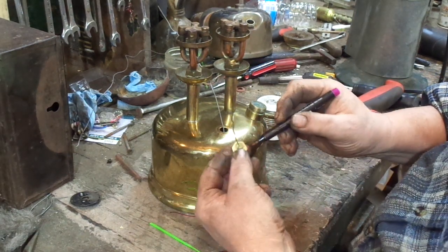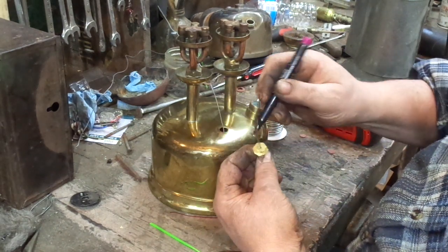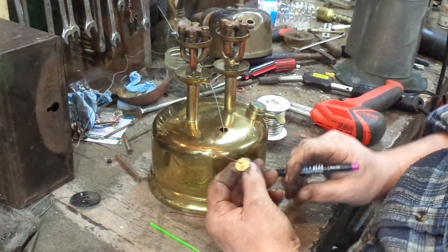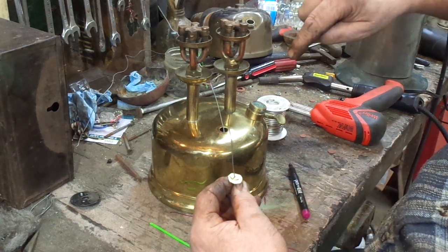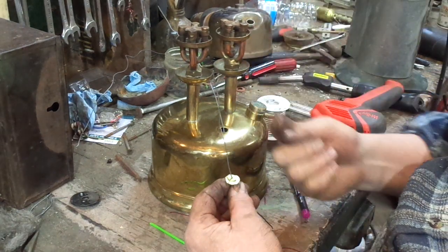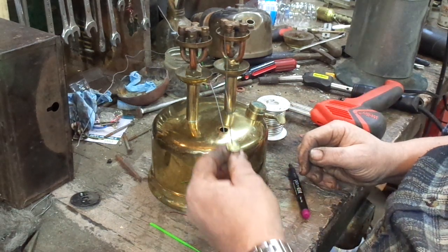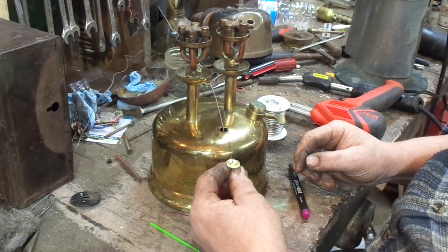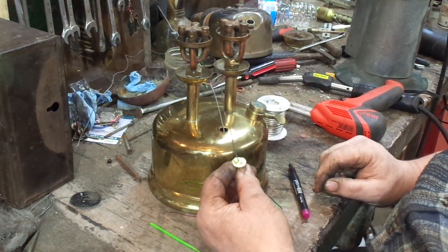So this is what I did: I cut a circle that would fit right in there and then I cut a backer piece. What you do is pull this through the lantern or stove, pull it up into place, and solder it. You've got to make your plug first.